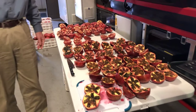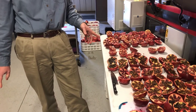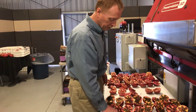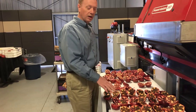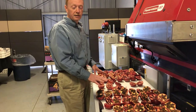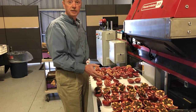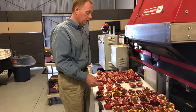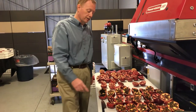So how many pieces did you use for this test? We used 200 pieces for this one test, and we tested it back on the same line. The rind variations have the most effect on the results. By using a very large sample, we can model out the variations in the rind so that it can actually separate the black heart. As we go into multiple lots, we'll need to add just as much data from multiple lots in order to model out the lot differences. It's going to take a large amount of data to create the model, but it clearly does work if we have enough data to model out all the possible rind variations.